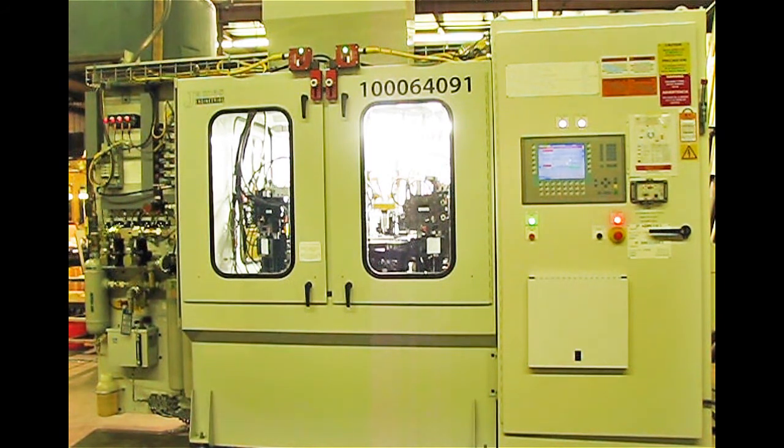This machine runs a snap ring part. We're deburring the snap ring land on a castellated part developed by three companies. After we engage a grinding wheel into the groove, we engage a brush to then radius the castellations. So we're doing two things: removing the burrs from the snap ring groove, and removing the sharp edges from the castellation machine.